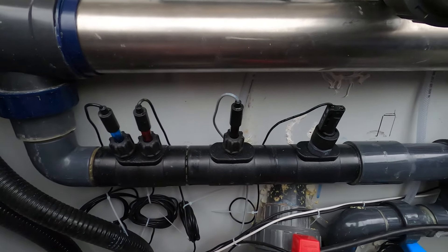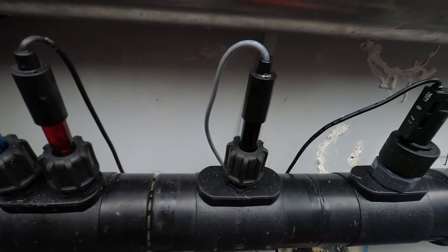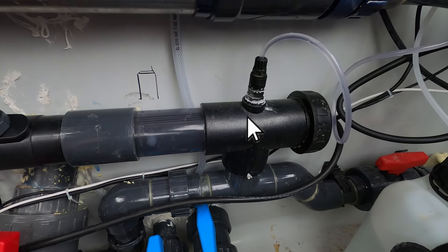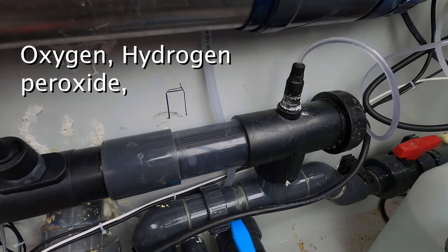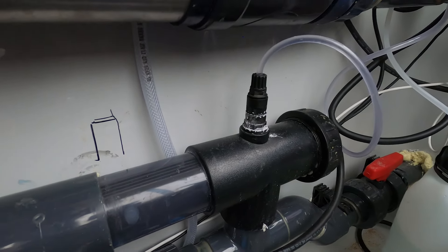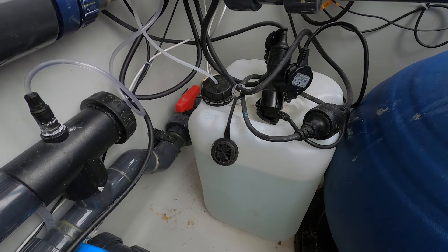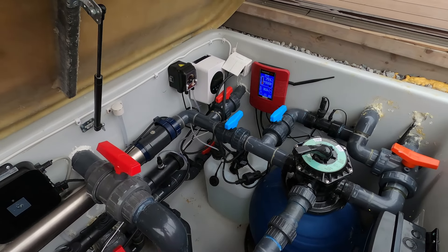The water then continues onto multiple measuring devices: a temperature probe at the bottom, a blue pH probe and a red redox probe on top, followed by a gray probe for salinity measuring conductivity, and then a mechanical flow meter that ensures hydrolysis is only turned on when there is water movement. The next step is the hydrolysis and electrolysis cell, where an electric current breaks down the water molecule and produces active agents such as oxygen, hydrogen peroxide, hydroxide, and ozone. The cell also supports low-salinity electrolysis where one to two grams of salt can be added to the pool water and the cell transforms the salt into residual natural chlorine for added benefits without the side effects of traditional chlorine. At the end of the cell, a dosing pump doses pH minus if the unit wants to lower the pool's pH. We have consumed very little pH minus this season — it is the only chemical needed, making the entire process of owning and maintaining the pool 100% automated.